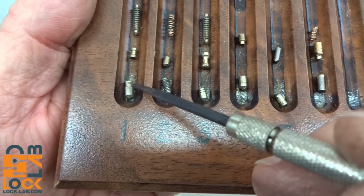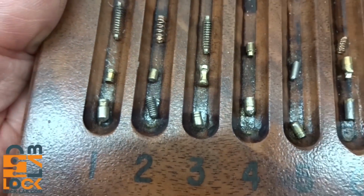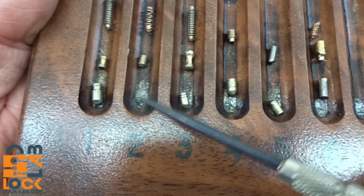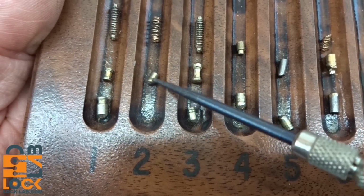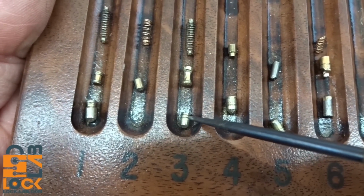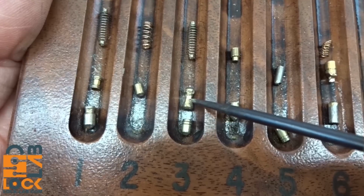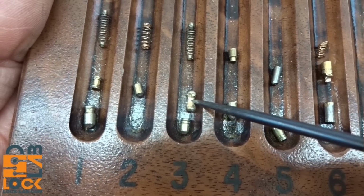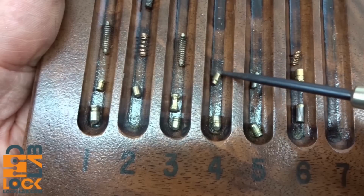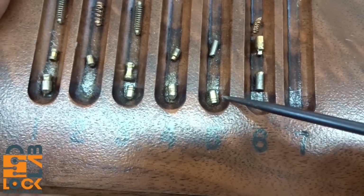All right, here we have a standard diameter, but it's a homemade spool, and upstairs we had a reduced diameter, very tiny serrated spool. On the bottom we had a steel piece of a screw, and then an American diameter driver. Actually, that's a key pin, but he was in the driver position. On the bottom we had an American reduced diameter serrated key pin, and on the top, the ugliest spool ever seen. I think he's not quite square. Maybe he's a 5-sided, I don't know. Down below here we had a very rough looking serrated key pin, and upstairs we had this reduced diameter American pin diameter T-pin. On the bottom, serrated key pin.